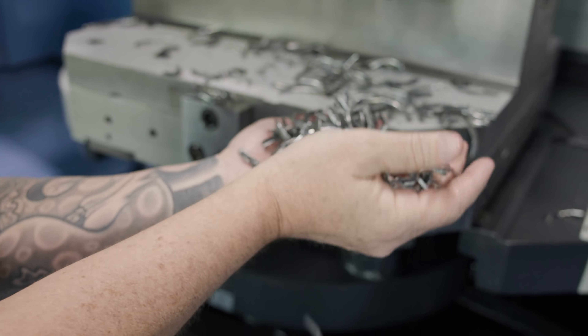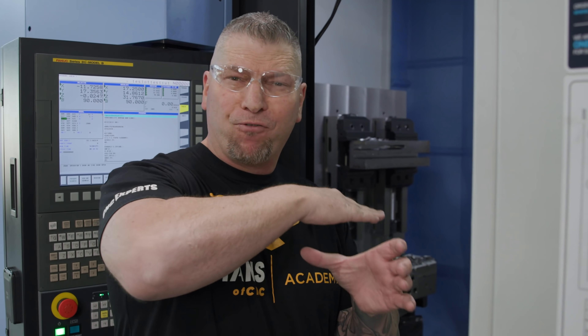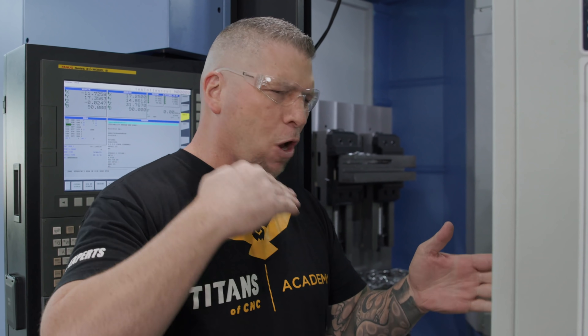How's that cut? Crazy! 550 surface foot, 0.001 — 0.002 inches per tooth — the Harvey 1 TE, three times diameter deep, full slot going through. We broke one end mill, but it was my fault. We didn't have air and we did not have coolant on that tool. In round two, we put on the Synergy 735 coolant from Blazer, went with the same parameters, and drove right through. You could just hear it pop right through — we had success!